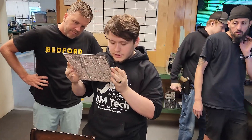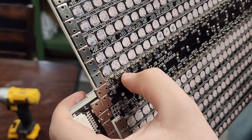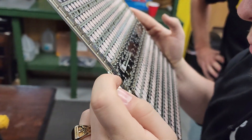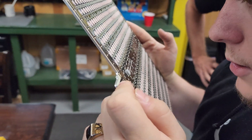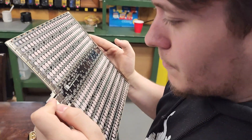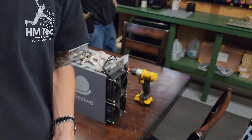Each of these digital IO groups has an SMD PTC — a positive thermal coefficient thermistor. I have to wonder if that's related to thermal management or if they just needed resettable fuses, but I think it's the former. It looks like they've decoupled every SPI bus line here, and then there's low-frequency decoupling with this big capacitor. Let's put it back together and run it and see what the numbers look like.